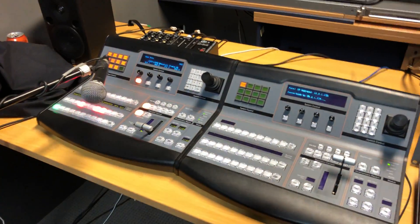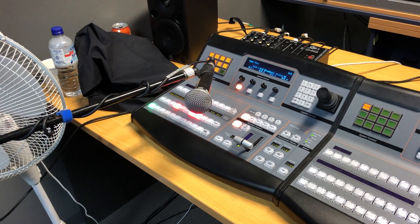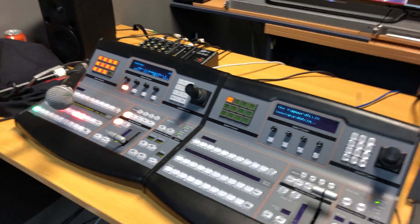It got a bit interesting when we had to put slides onto the web stream. In future I would do some different things when it comes to macros and that kind of thing — so they all talk to each other, but overall it actually worked quite well. Essentially, because each ATEM switcher has to run in one resolution and one frame rate, you can't mix and match things — there's no scaling or anything done. Running the two switchers actually worked quite well. In the control side, we ended up having two panels next to each other: the left one running the broadcast studio and cameras, the right one running all the screens. Although most of the bits were all triggered by macros — because we've got side screens, center screens, fallback screens — macros became our friends.